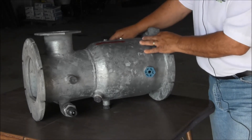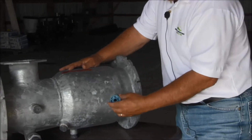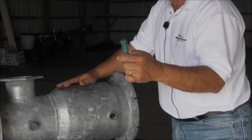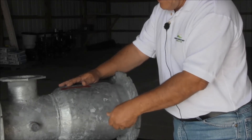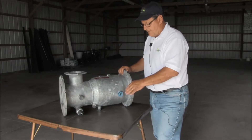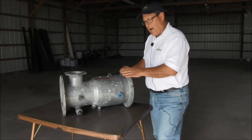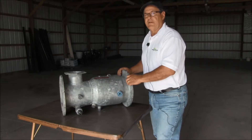What you have after the flapper valve is a little injection port, and in that port it has a spring-loaded ball valve so that if your irrigation or injection pump would happen to stop or quit, and stop pushing fertilizer or whatever into it, it will not allow water from your irrigation system to flow back into your tank and overfill your tank.